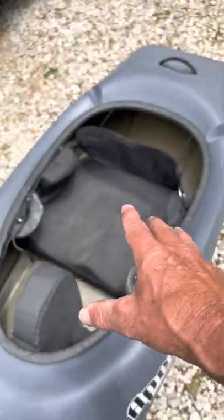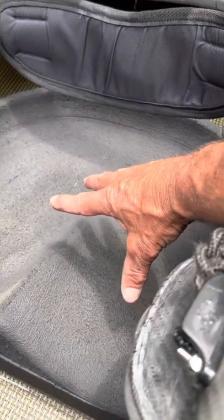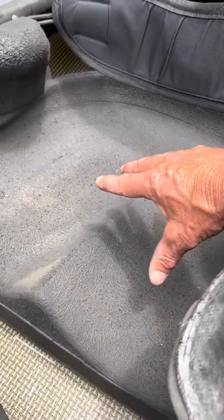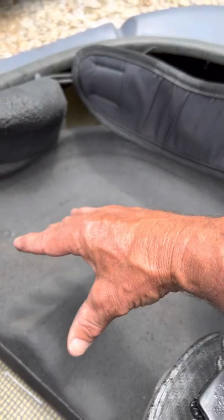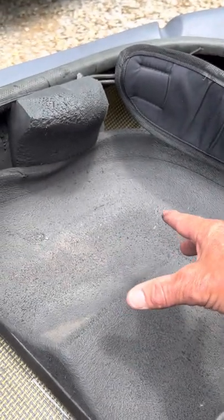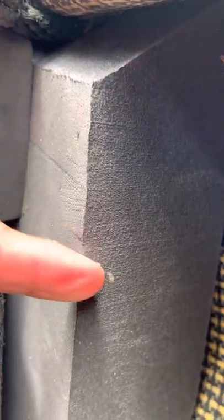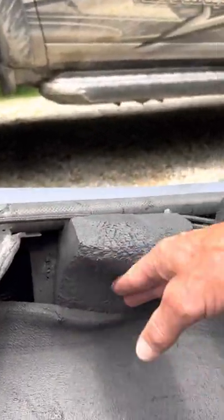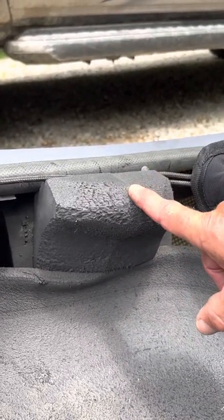A skinny seat gives you a lot of control. The beautiful thing about a full foam mini-cell seat is all that thickness — it's all padding, all soft, all comfortable. Because this seat is a CAD file, I can design exactly the ergonomics for comfortable all-day seating and a lot of control. On the sides, the seat is held in by vertical three-inch mini-cell blocks that fit perfectly between the seat and the wall. Those blocks are what the hip pads attach to — pure mini-cell, hand-formed, but we will have a CAD file.